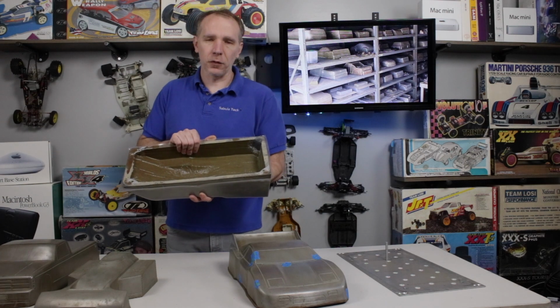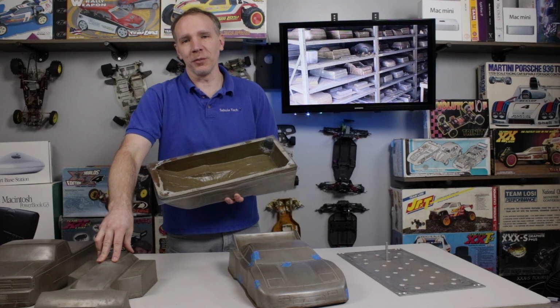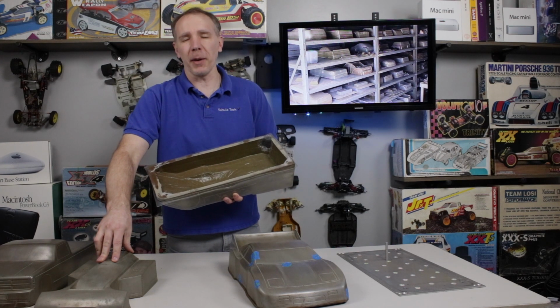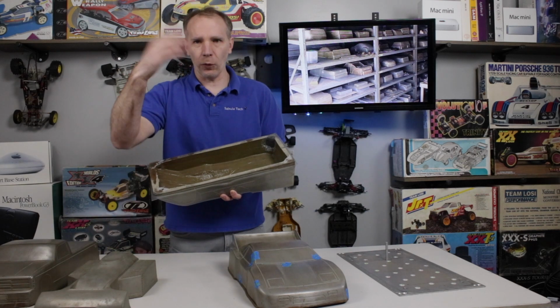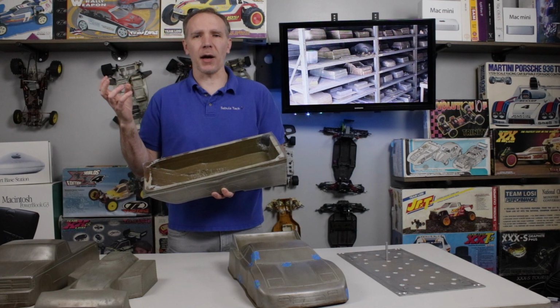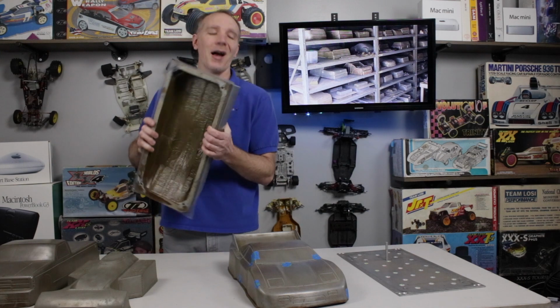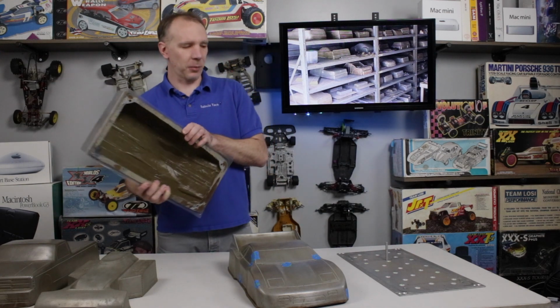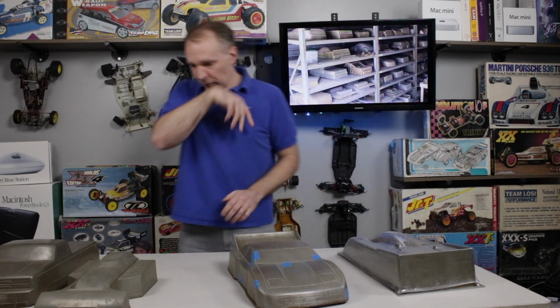Then if you try to do something real thick like this, at least a couple of manufacturers recommend you have real larger aluminum chunks in it, so that it doesn't shrink up too much and just deform, with too much of that epoxy resin. Because one thing these things can do when they're curing, they can get incredibly hot actually. What do they call it? I think an exothermic reaction takes place.